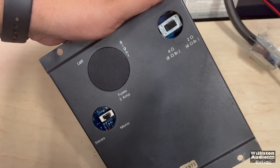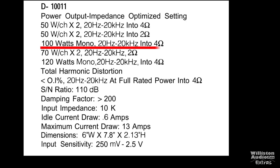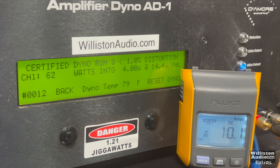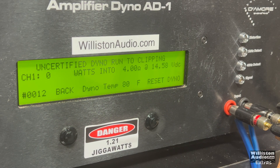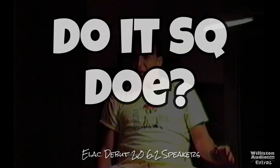Efficiency in bridge mode: about 40% — pretty abysmal but expected. Now switching to the 2-ohm stereo / 4-ohm bridge mode, which lowers the rail voltage. The amp is rated 100 watts mono in this mode. At 40 Hz, certified: 93 watts at 14.42 — close but no cigar. Uncertified up to clipping: busts through the 100-watt rating at 108 watts at 14.3 volts. This is a 32-year-old amp — no complaints. Dynamic: getting into the triple digits, 116 watts at 14.42. Efficiency: 44%.